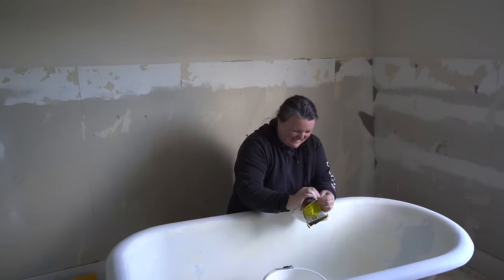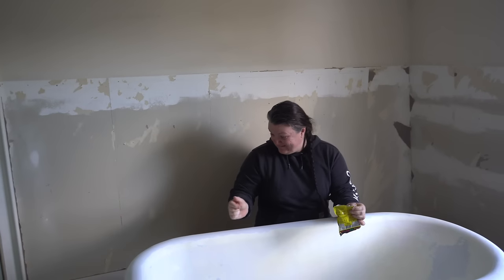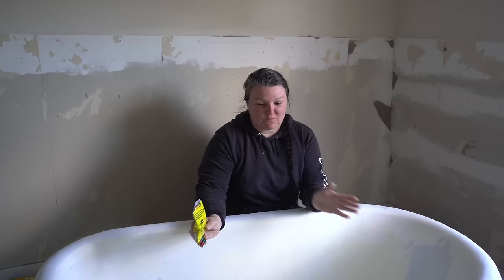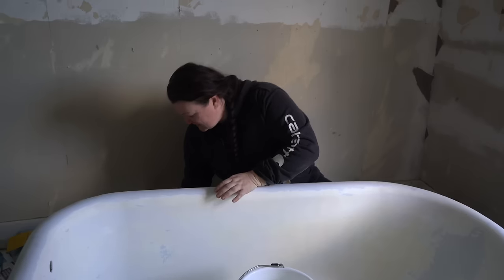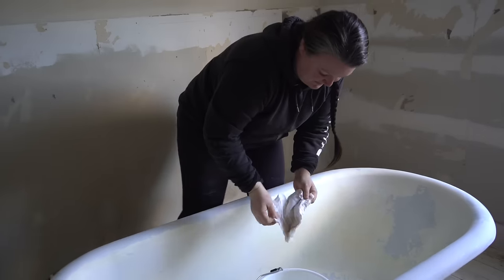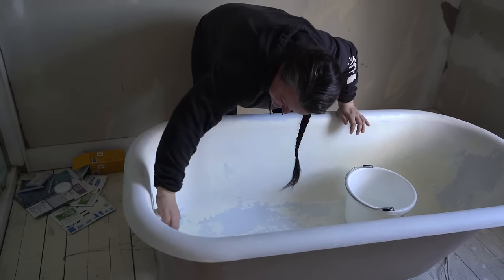After what felt like 300 hours of trying to sand this tub using two different types of strippers — none of which pulled anything off — and Alicia's elbow grease, the tub is now ready to be painted. We're going to use the TSP that came with the Klink's tub prep kit and just do one last wipe over. I just want to make sure there's no debris in here at all. The time clock has been ticking on my parts A and B. We're just going to wash this one last time, let it dry, and then put on our first coat, which from the directions is going to be the thinnest coat possible. The kit came with everything we need, which was kind of convenient.